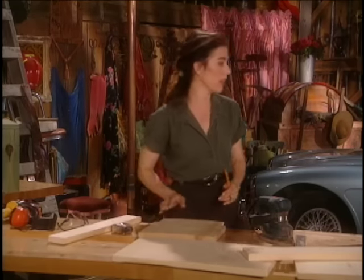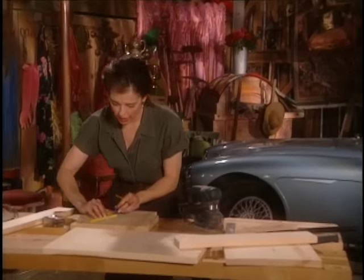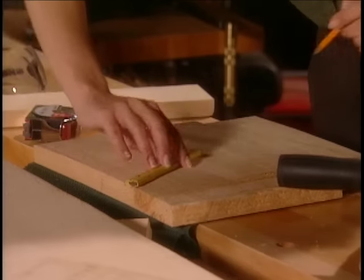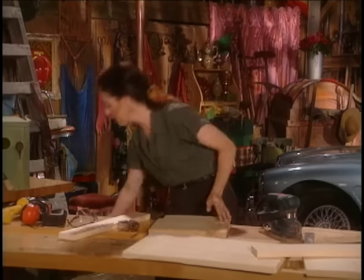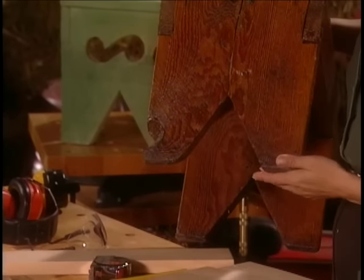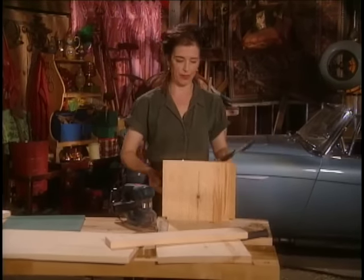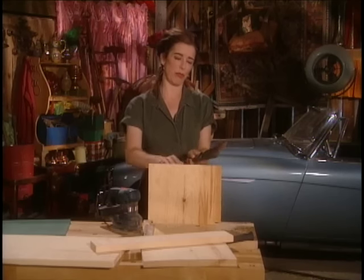So roughly there and there. I'm just going to take a straight edge and divide them. I'm just going to trace it like that and like that. This isn't a time to get all crazy about being terribly precise, because the benches look — I mean look at this one — it looks nice, it's got a knot out of it, it looks kind of cool that way. Cutting this is sort of the same as what we just did, but you're fighting across the grain and ripping at the same time, so it gives you a little bit more of a fight.